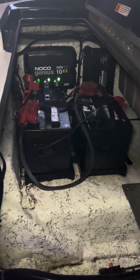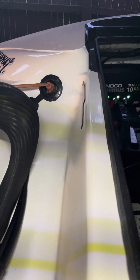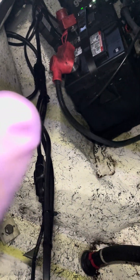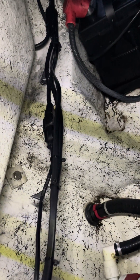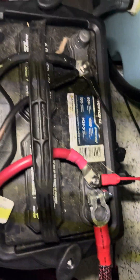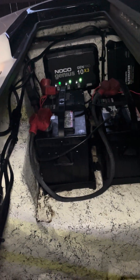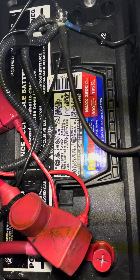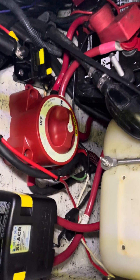When I get home I plug in to the new port I put in — there's a plug there and a plug there. This plug right here runs the onboard charger that charges the starting battery. The other plug right there turns on the 10 by 3 charger, which charges the trolling motor batteries and the house battery or accessory battery.